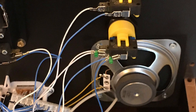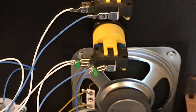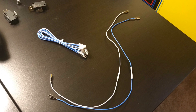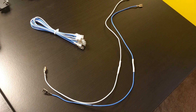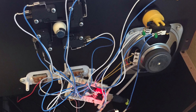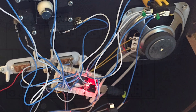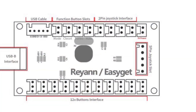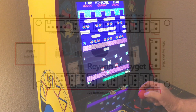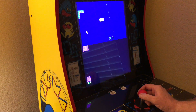I am still using the buttons I added, so I connected A and player 1 start together using a daisy chain connection I made from extra button connections. To do this without extra buttons, simply use zip ties to connect the wires for the button connector you are using for player 1 start to the A button microswitch, and plug it into the location where you originally mapped player 1 start. Make note of this location on the encoder board, as you will want to map the player 2 start on the second encoder in the same location as the player 1 start on the first encoder board.